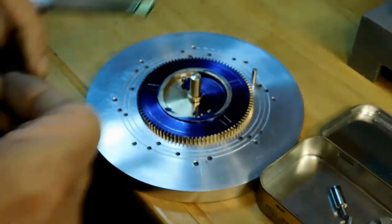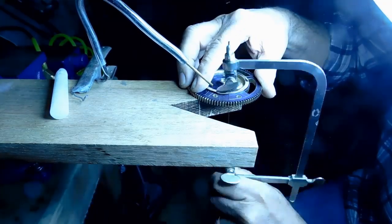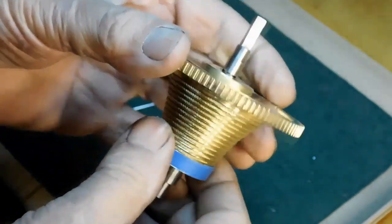Now we're using a Wilder's crossing-out jig to cross out the wheel, and we're on the piercing saw now to cut those sections out. After cutting them out, we do a little filing and then a little bit of sanding. Now we're ready to get the fusee on there.